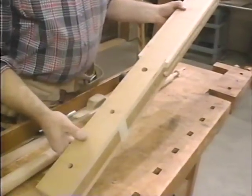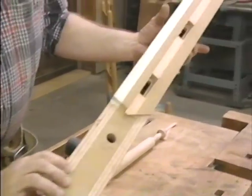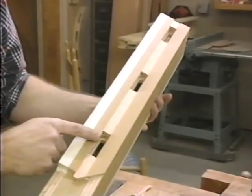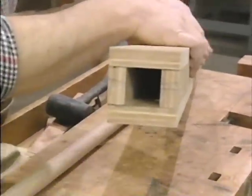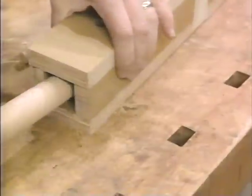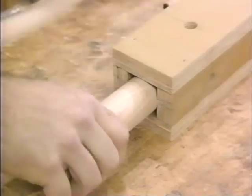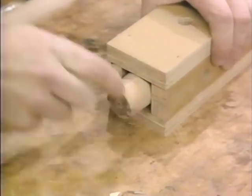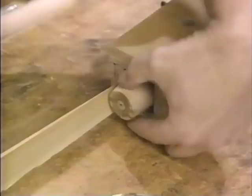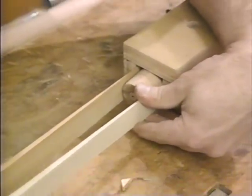It's constructed from plywood, and it has holes for the various rungs and stretchers. And then up on this side, there's even slots to cut the mortises for the back slats. The inside square is 1.5 inches, and that's so that it's just snug around the widest portion of the back slat. So I just slip it into place, let about 1 inch stick below the bottom, and take a couple shingles and just wedge it into place so it can't move.